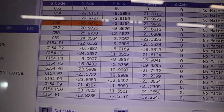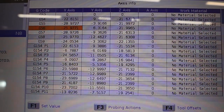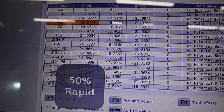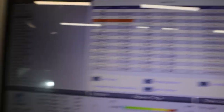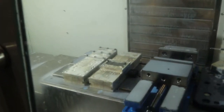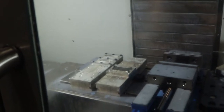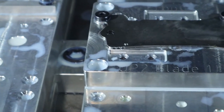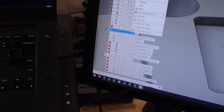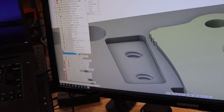I actually didn't notice a change but I was staring at the X-axis. You guys have the power of rewinding and I don't. Here's the engraver — hopefully that goes good. I don't think the engraver was supposed to drill a hole. Something really interesting: if you don't change the actual offset you're working in to 7, it'll do weird things like that. Good thing I stopped it before I made a turn.